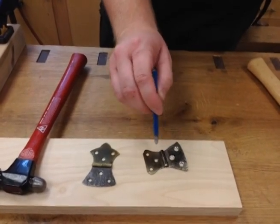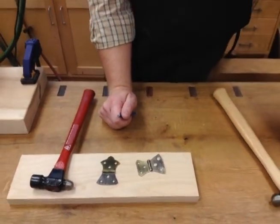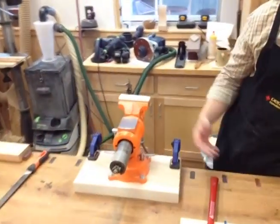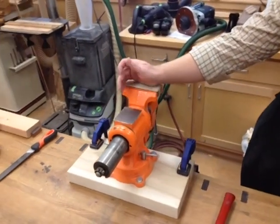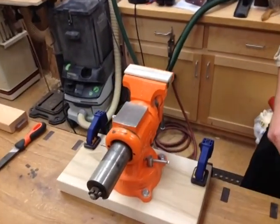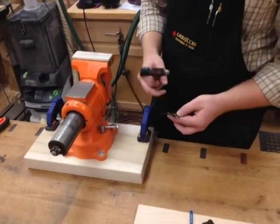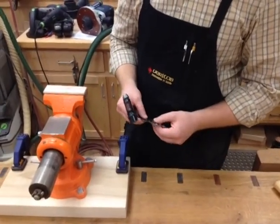This one is actually a pretty good hinge. You can see on this hinge it's a little bit wonky - they're not very expensive hinges, so you might have to do a little bit of straightening once you're done anyway. The last thing I'll say is about something hard to pound on. I'm just using the little anvil on the back of my bench vise or machinist vise. I just want something flat so that when I pound, the hammer rebounds. If I put this on a piece of wood, you certainly wouldn't get the decorative effect and you couldn't stretch the metal as well.